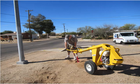I do recommend, especially when you're working by yourself, spend a little money and go get a nice auger. You can get those handheld ones, or maybe get a friend and do them. But something like this, that you tow behind your vehicle, it's worth it. And I wasn't able to get down to the 2 feet on all of them. Some of the dirt around here gets really hard, and it'll just spin. So I had to use San Angelo bars to get down the last, sometimes 6-10 inches that I wanted to get. But this got me a good chunk of the way there, and it got me there pretty quick. So yeah, I recommend it.